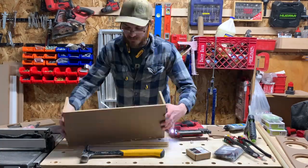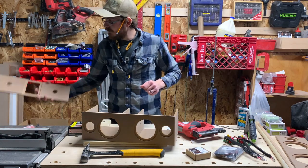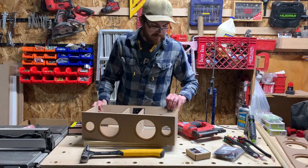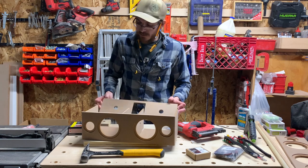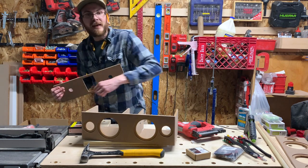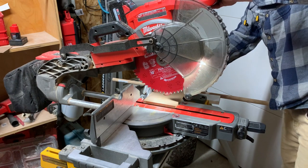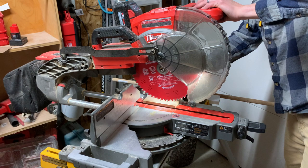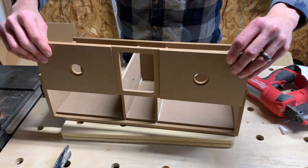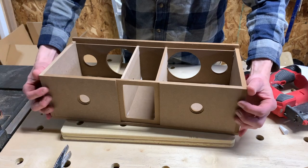All of this to say it's fairly straightforward to put this assembly together. The four sides, top, bottom, they all fit together — rabbited, grooved, dadoed, whatever you want to call it. So first problem is this is too wide for what's back there, so we're just going to have to trim off about a sixteenth off one of the ends to get this to fit where the sides are still lined up nice and flush. We'll move over to the miter saw. And that is the nice tight fit that I was hoping for.